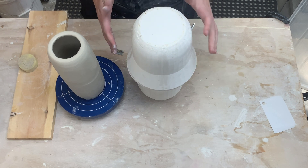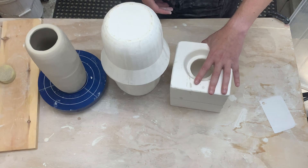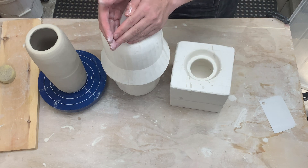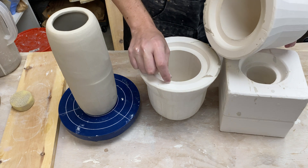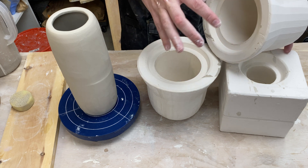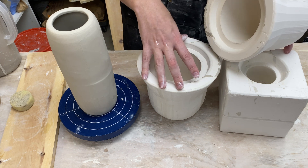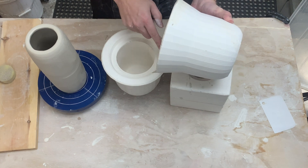So I'd really like to get my molds to do this like the one I showed at the beginning of this video. Can I stack two of these together? Well, not really — there are a couple of problems. One is there's no hole here so I can't pour the slip in and back out. It's the equivalent of this hole in the two-part mold — we somehow need to put that in the top. And then the other thing is our slip well is getting in the way. This is great for one-piece molds — it gives a nice shelf to trim against and extra headroom so the slip has a place to shrink into. But if we put a hole in the mold here so we can pour the slip in, we have the problem of the slip well itself getting in the way. However, that does point towards the changes we need to make to the molds in order to do a two-piece mold like this. So I'm going to start thinking about how to do that using ShapeCast, and in the meantime, if you have any questions or comments, do let me know. Thanks.